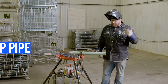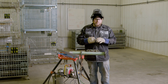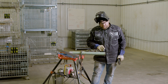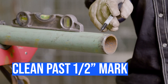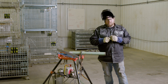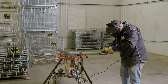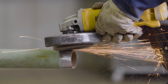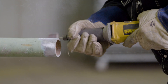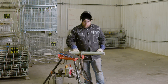One of the first things we need to do is prep this thing up. I'm going to stick my fitting on here, grab a marker or soapstone, and mark it right here - that tells me how far I need to clean. I want to clean a good half inch past that mark. Go ahead and get our tiger paw fired up since this is coated to get it off faster, then finish and clean it up with the angle grinder and the flap disc.